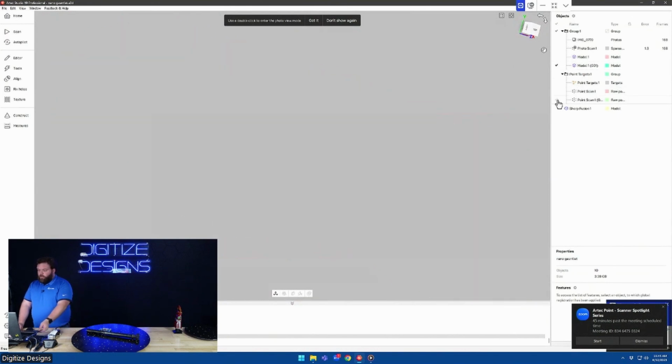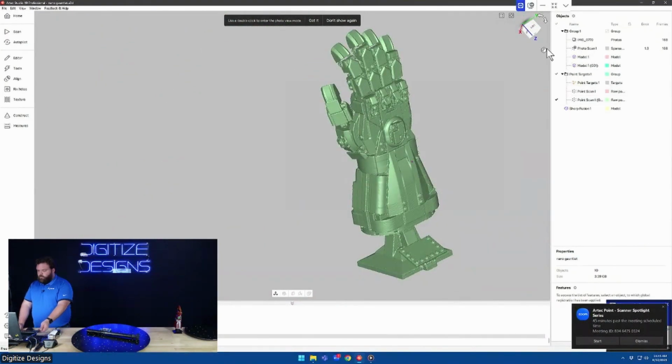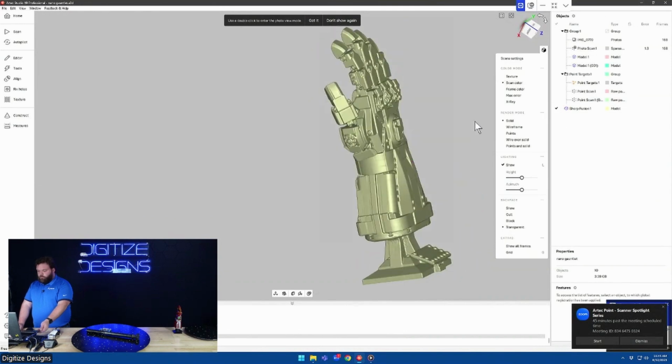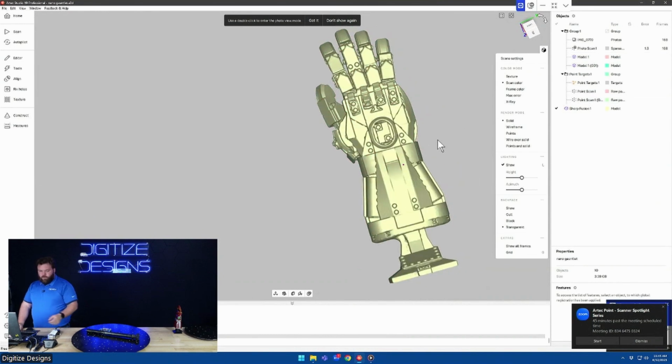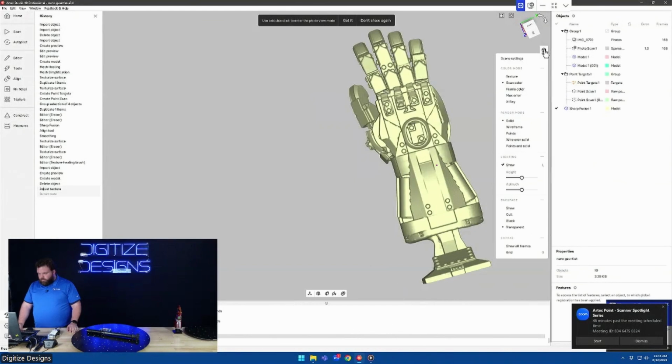So I then came back and scanned this with the point, and so here's the result of that. That's just the point cloud. Here's after my fusion. And the cool thing here is when you scan with just photos, nothing's to scale. So this came in, it was like 20 times larger than the original, but Studio can handle that. It can automatically, through the alignment tool, the same thing you saw me do with the 2 bell housing scans a minute ago, it can go back and, actually, I'll show you. I'll pull up the history. We'll go back and see what that looks like.